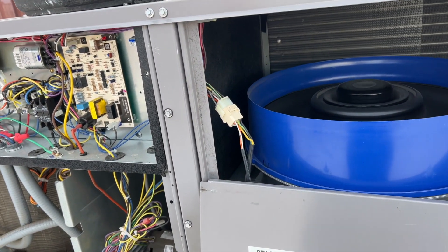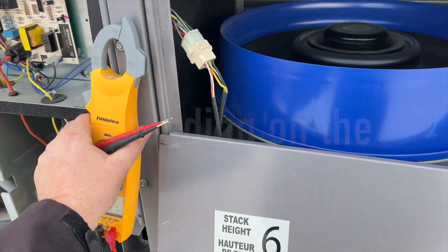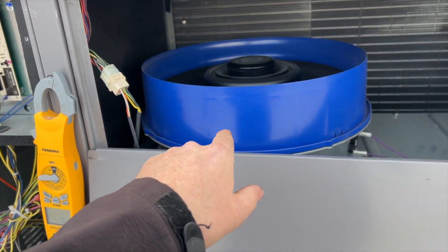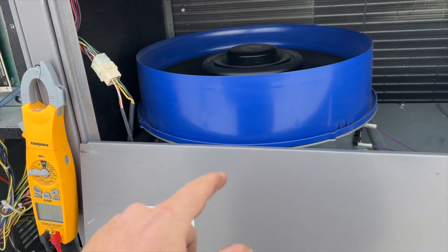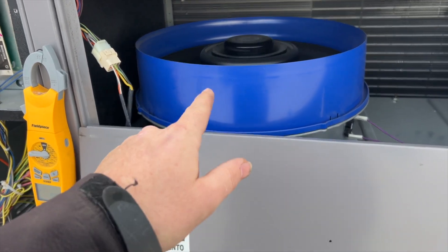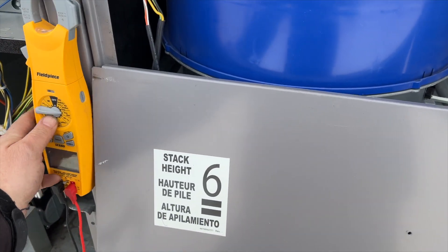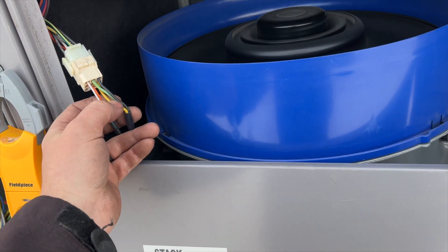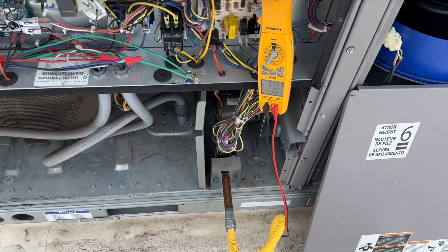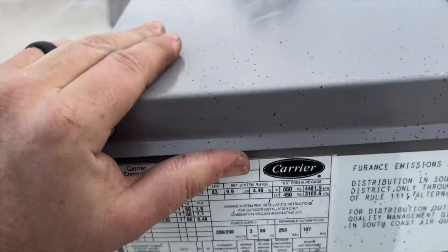Communication is between 2 and 10 volts DC; gray to white is communication, orange to white is steady 10 volts DC. I suspect this thing overheated, went into thermal overload, so we may still have a motor issue. We want to get our amp draw since it's running at full blast right now — checking on our high voltage lines. We're getting about 6.48 to 7.1 amps.